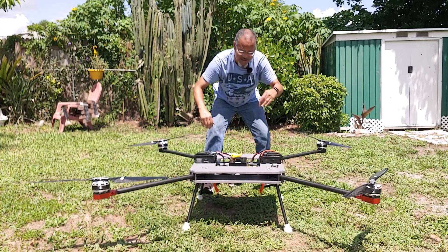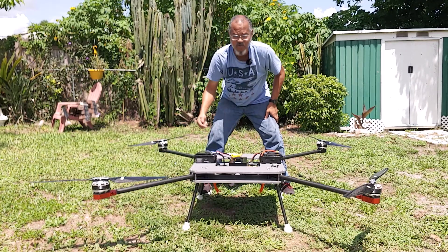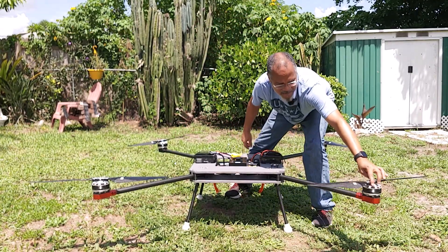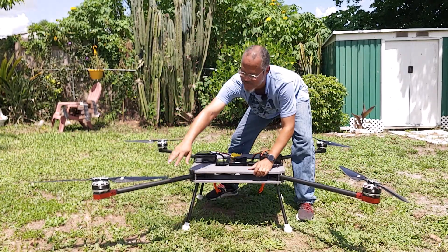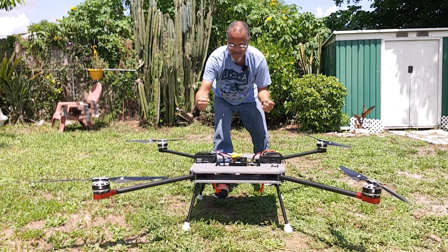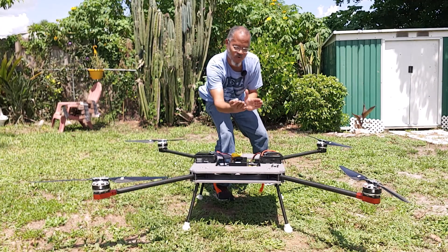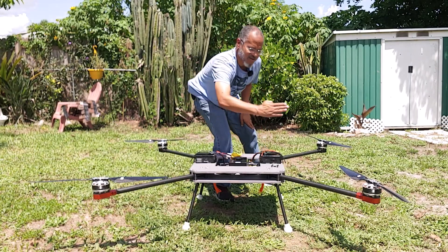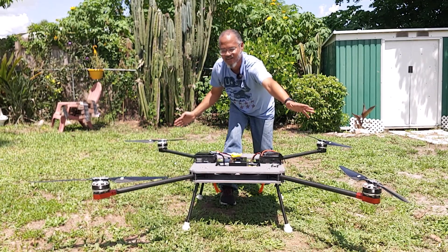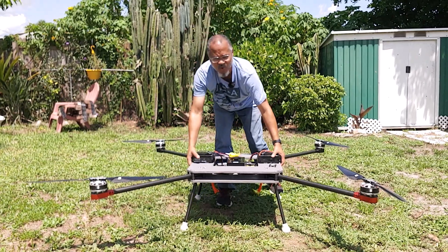So you've got one pair doing this and the other pair doing that. When all four are going at the same speed applying the same force, the torques cancel out and you don't have any turning motion. Now if you want to yaw in one direction, you spin two of the motors faster while slowing down the other two a bit, so the net upward force stays the same but the net torque pushes the drone to spin counterclockwise. Reverse it — spin the other pair faster — and you get yaw in the opposite direction.